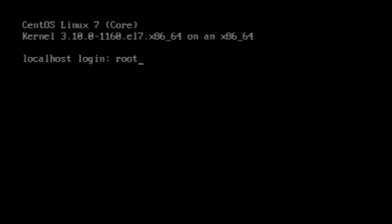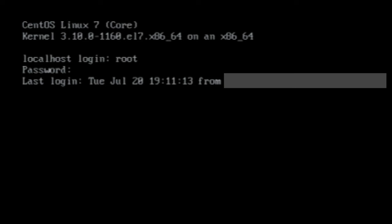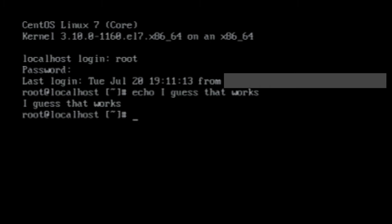And I think that's the ideal BIOS setting for a situation like this because if the power were to go out, like during a blackout or what have you, I would want the motherboard to come back on and continue doing whatever it was doing before when the power comes back on. I wouldn't want to have to go out there and hit a power switch or somehow manually intervene by turning this on. So as long as power comes in through the power cord, this computer will turn on by itself.